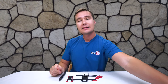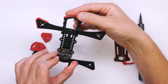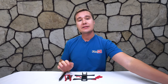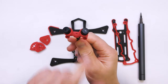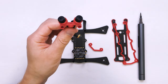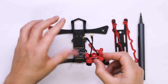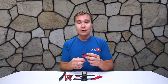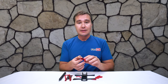It's completely optional but I think it looks really nice — let me know in the comments what you think. It adds a couple of grams. I have one for the top plate, one for the bottom plate, and one for the front piece. I also adjusted the rear antenna mount design. I increased the space between the antennas — some people commented they need to be farther apart. Now it's 40 millimeters at the edges. Space is very limited because the air unit is mounted at the front, so I did my best. It also has a mount for the buzzer.